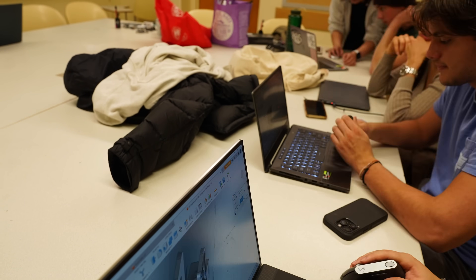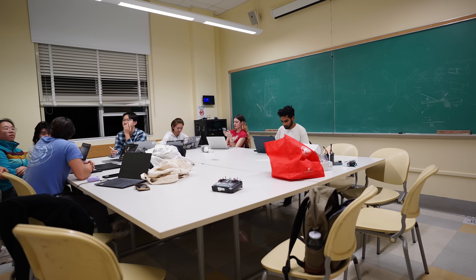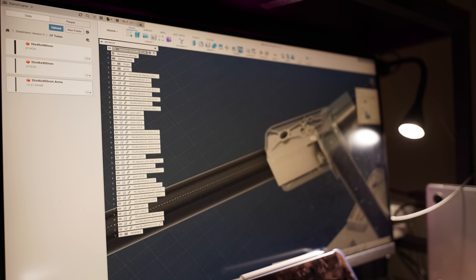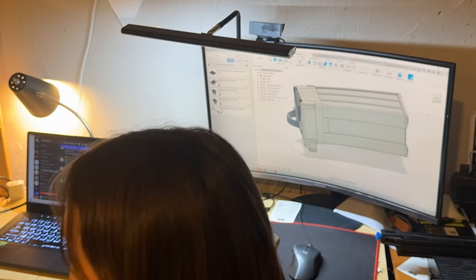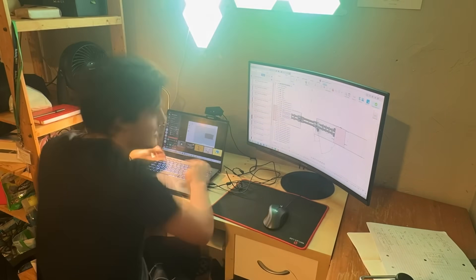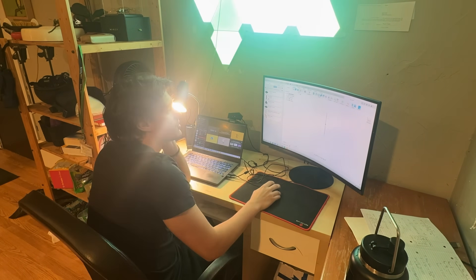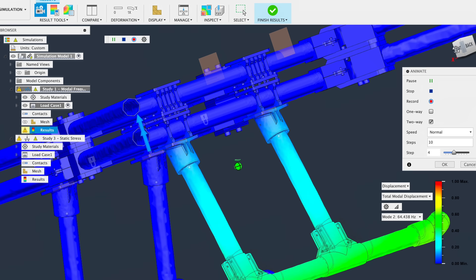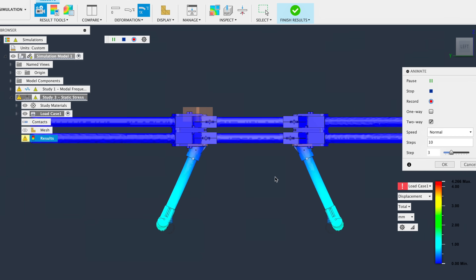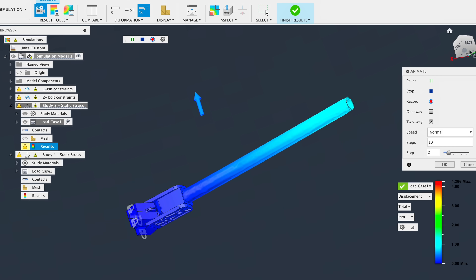Despite the design being a rectangle, the process was nothing one could call easy. I was very fortunate to have a group of UC Berkeley students who studied mechanical, aerospace, chemical engineering, and physics to help me bring our sketches to the blueprint. Despite having a bunch of us working on it, we still often pulled late-nighters until 4am. The details were super important — we analyzed the optimal setup for every bolt and nut, from the precise length, material, tolerance, and static loads. We ran many simulations in the software, hoping to create a lightweight framework that is also able to withstand the forces during flight.